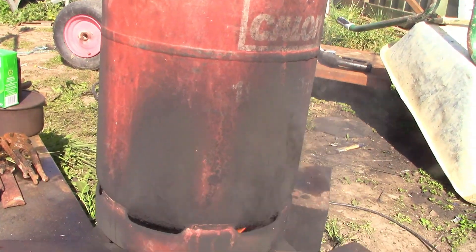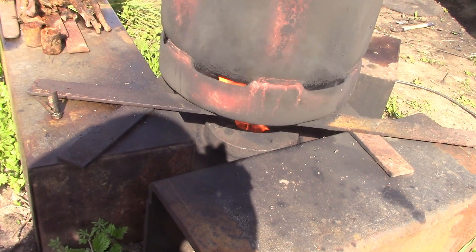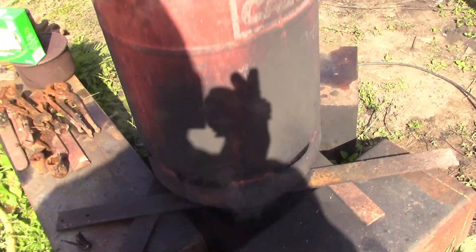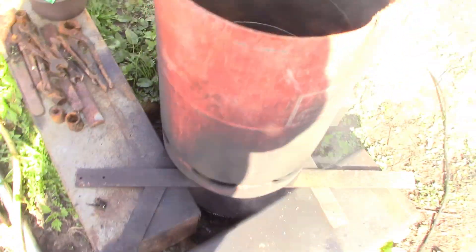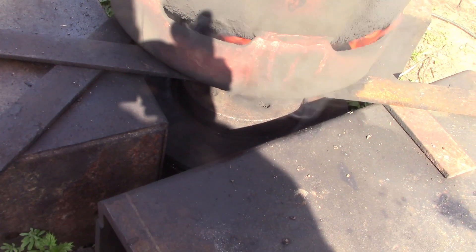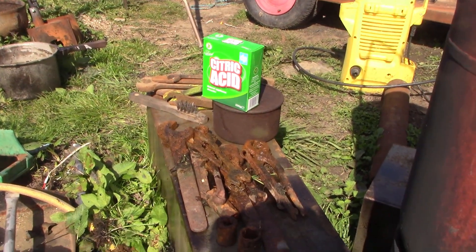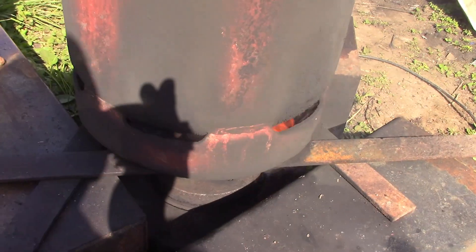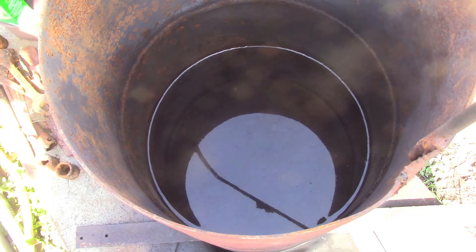So this is a gas bottle — I started using this to clean engine parts, but I've been using it for cleaning rust off iron parts now as well. Right now we've got some water in there warming up; it does seem to give it a bit of a head start. I'm not going to keep this burner going the whole time, I just want to get the water hot just once — that seems to work okay, and then it can cool down. We're going to leave these parts in here for the next sort of 12 hours I suppose, might end up being longer. It's not a quick process, basically what I'm saying — you do need to leave a little bit of time to do this.